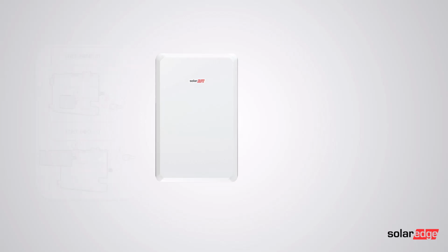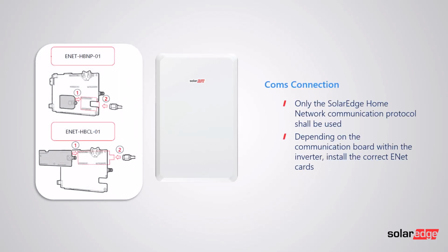The communication for the system is only available via the SolarEdge Home Network communication protocol, and what's really important is you make sure that you use the correct card. There are two cards available, that's the ENET-HBNP-01 and then there's the HBCL01, which is a much larger card. The larger card used to be installed on the older systems. A couple of years ago we updated all of the cards going out on the current inverters to having the dual slots, but what's really important is if you have a card with the dual slots, only use the smaller card, that's the HBNP, do not use the larger card.